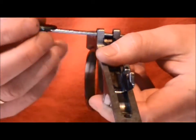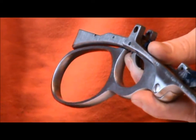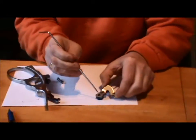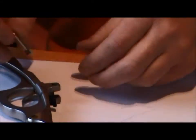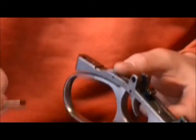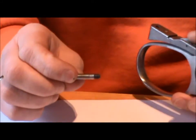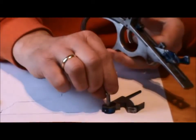There is an easy thing: you can line the hammer, and it will align after the hammer - you have to stone the notch if you've already stoned it. You can bore out this hole and press in a bushing, and you can hone it to fit your pin. But it will also be loose here - I don't know if this hole is bigger than that hole. If you have access to a lathe, make yourself a bigger screw - make it to fit that hole.